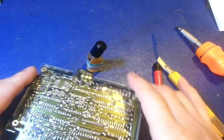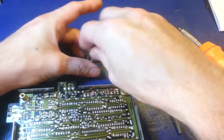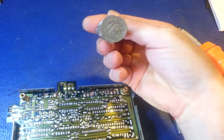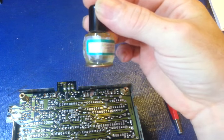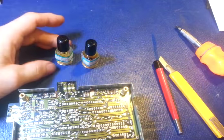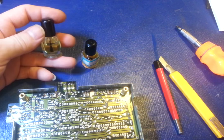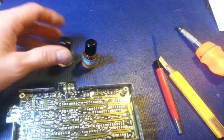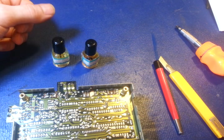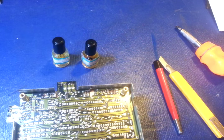Well, what happens, you spin whatever around, you bump the bottle, and then you knock it over, and now you've got flux all over the damn place. So to prevent the bottle from tipping over, because the problem is they're a little bit top-heavy, they're really small, there's a quarter. I just took a little bit of glue and glued it, and all of them, because I had several bottles like that with different fluxes that I use. Like this one's my homebrew stuff I make from pure rosin cakes, and it's just dissolved in IPA or isopropyl alcohol. But like I say, this makes them a lot more, you can see that, they're self-righting. And without that quarter on the bottom, you only need to get about that far and they'll fall over. So just a little tip.